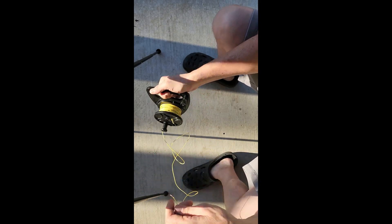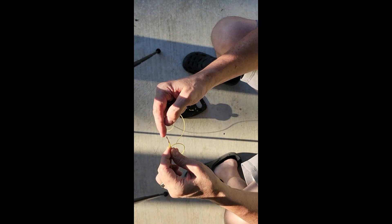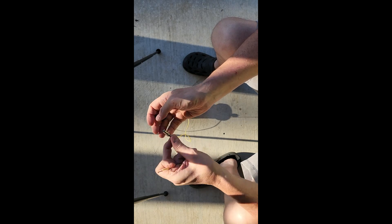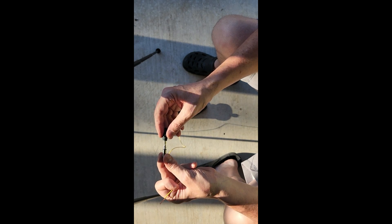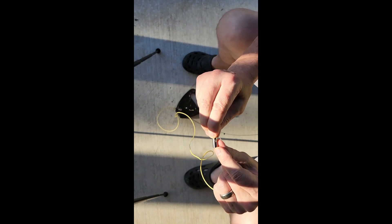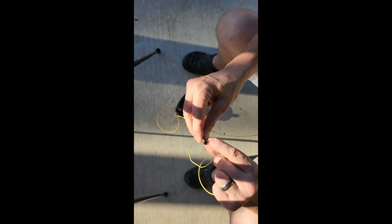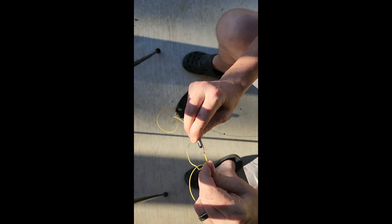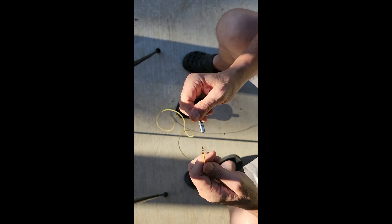You can see this lever keeps it from going backwards. Now for the banana plug: unscrew the cap, and inside there are two tiny flat-head screws on either side. I doubled the wire up since it's a single wire, so there's more to grip. Slide it in, tighten down the two screws, and screw the cap back on — and you're ready to go.